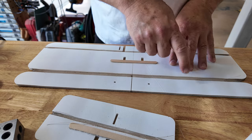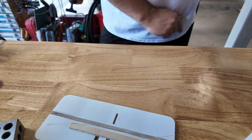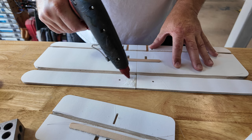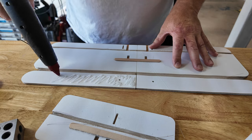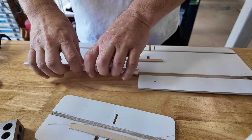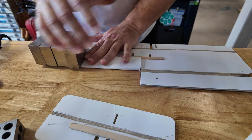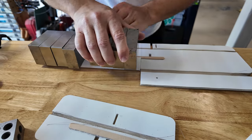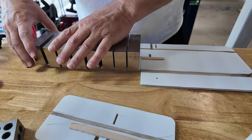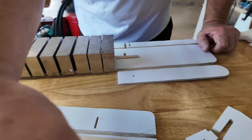Let's go ahead and do a little bit of hot glue. That's our CG mark. My CG marks are not the definitive be-all-end-all - this is not absolutely where it must be. They're basically a swag, and I have flown them with it, but it's just a determination that this is a safe CG point that it'll fly. You can take it back if you want a little more instability and acro performance, or bring it forward for more benign flight characteristics.